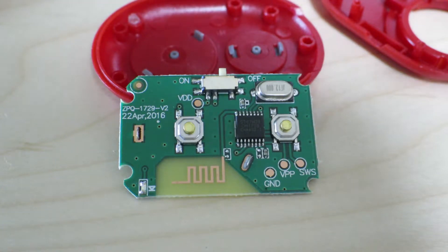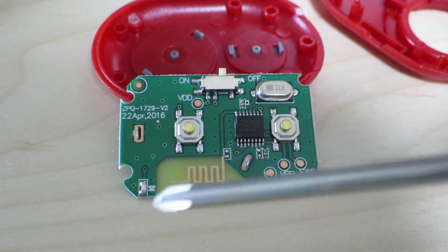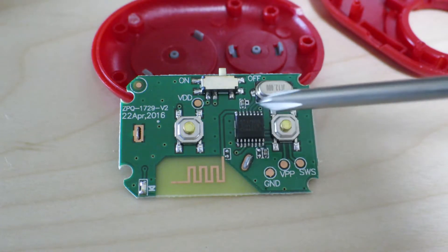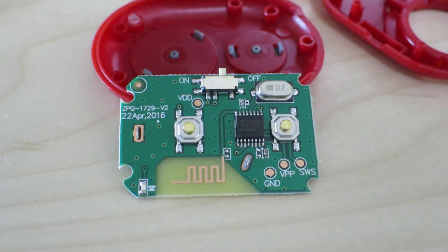Taking a closer look at the circuit board, we can see that there's the two push buttons that power the two shutter buttons and a 12 megahertz crystal up here. And this is the LED over here that was flashing before in that blue color. We can also see that there's an antenna over here for the Bluetooth. And this chip over here is the brain of it all — this is the Bluetooth chip, marked ST17H26. There's not a whole lot of information about this chip out there, but I did find one site that mentioned it. It was included in part of a Bluetooth anti-loss tracking tag alarm patch or whatever. And this guy really didn't find a whole lot of information on this as well, but he's gone a little further and found some more. So I'll include a link in the description so you can take a look at it for yourself.